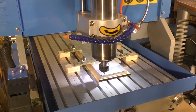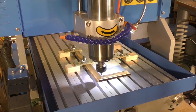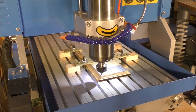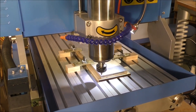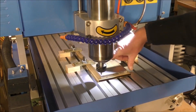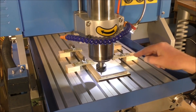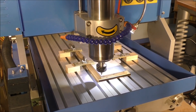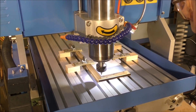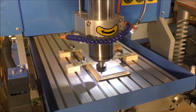And we get somewhere close. I've got plenty of material here — this is 100 millimeters wide and we're only cutting an 80 millimeter piece, so I'll take it onto the material a bit so we cover everything. That's fine. I'm going to set the X and Y zero there — you've all seen how I do that.